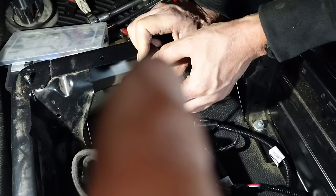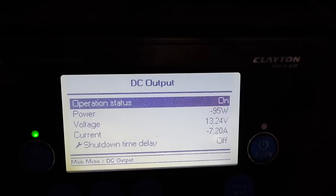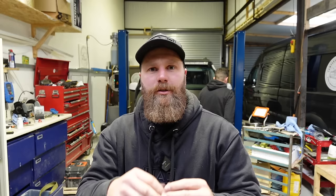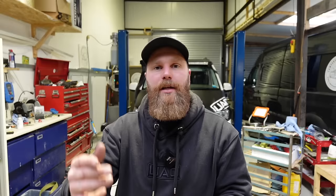We have power - that's the temperature at the remote. At this stage the unit is at about 95 watts, which means it's heating the glow plug. The pump is ticking away nicely and the fans are running. Do not be surprised if you see fault 13 flash up on your remote control - you are drawing diesel through for the first time. It runs, realises it hasn't quite got diesel yet, goes into fault mode. Reset it and it starts again. Once the unit starts to get diesel it will run; as soon as you feel heat you know you're there.